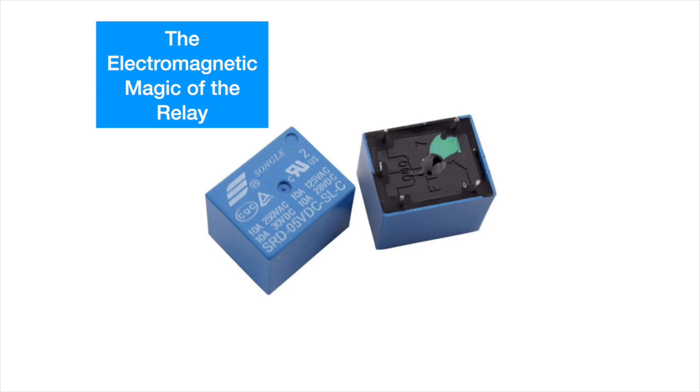A relay is effectively an electromagnet. We probably all had a go at building these as kids — wrapping wire around a screw and things. When you apply electric current through a coil of wire, you develop a magnetic field, and that magnetic field in the relay pulls a little bit of metal from one place to another and completes a circuit — that's the switch. It's really two separate circuits: the switching circuit, which are these two poles here, and when you complete that circuit that's when the switching action takes place.